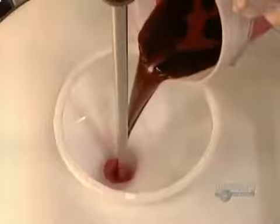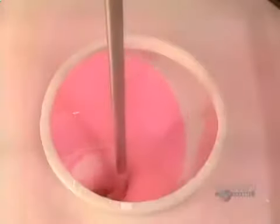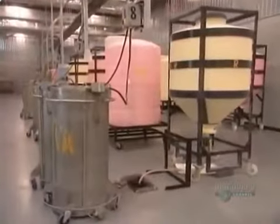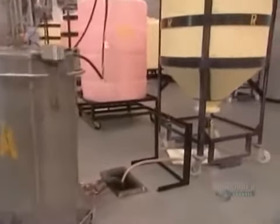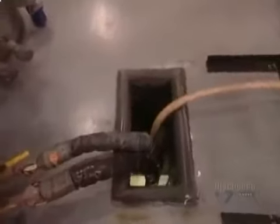Elsewhere in the factory, they use the same method to dye what's called the fill, the paint that goes inside the shell of the paintball. It's made of polyethylene glycol, the inert liquid in cough syrup. They thicken it with crayon wax. The gel and fill meet their maker in what's known as the feed room.